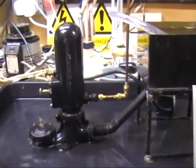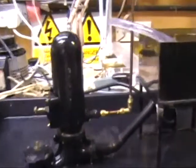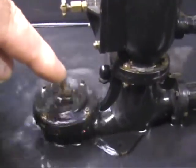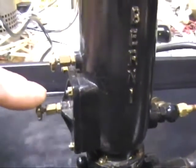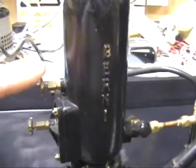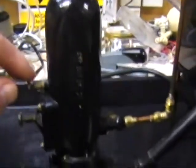This little ram pump is only about eight or nine inches high overall. The clack valve has to be adjusted very carefully using this adjustment here to get maximum efficiency. These valves here are for letting water out of the bottom of the receiver, because over time it can fill with water too high and not enough air, so you have to be able to let that out occasionally.